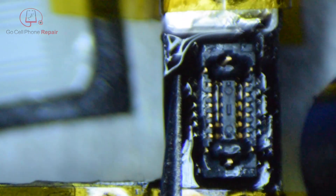Next is the fun part. Getting these things centered is always tricky — it's particularly challenging when you're right-handed and you've got your hot air in your right hand and you're trying to steady things with your left hand; it's not the ideal setup. That's pretty much lined up, so I'm going to go ahead and hit this with the heat. I was at 365 degrees with my airflow all the way down to 30, and it still didn't take very long at close distance — probably an inch or two away. That thing sat real fast and is aligned almost identical to the way it was from the factory. Now I'm just going to go back and touch these up with the iron to make sure we have a good solid connection on both sides.